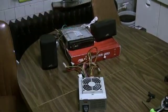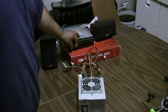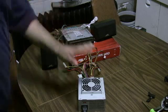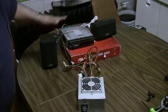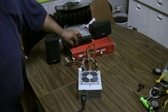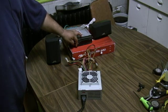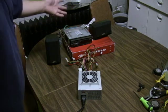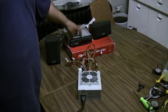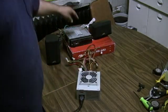We've got sound! Let me find a station. There you go — we're going to make a tabletop stereo. The stereo is powering up. With a 185-watt power supply, we have both speakers powering up. At low volume it's clear, and at high volume it's very loud in here and very clear — 8 ohms at 100 watts going into the car stereo out of a 185-watt power supply with a 12-volt 10-amp rail. It's powering perfectly.